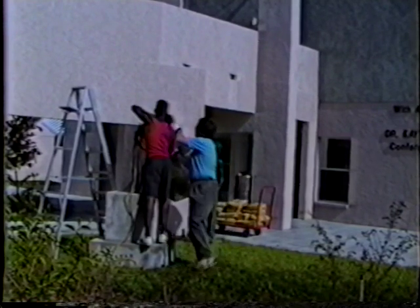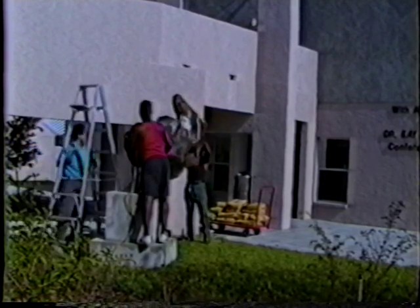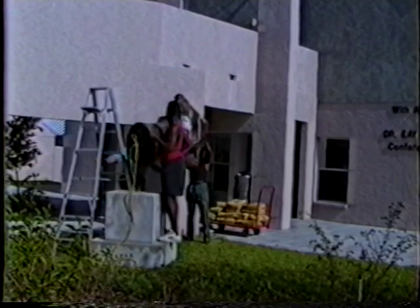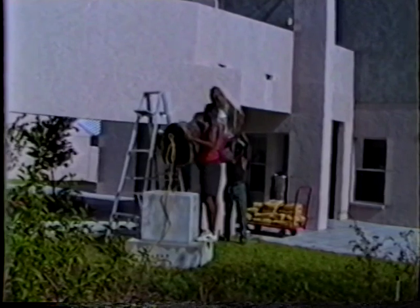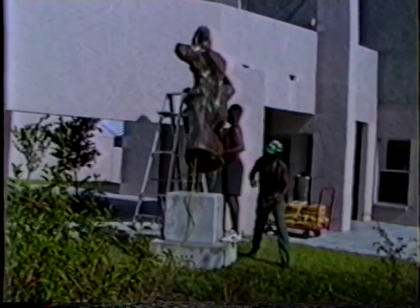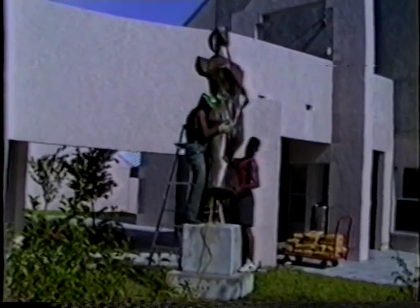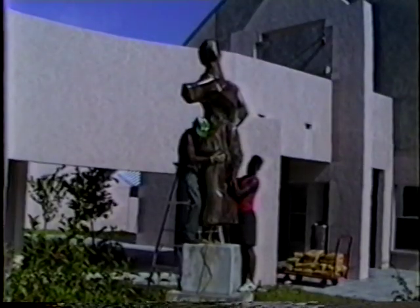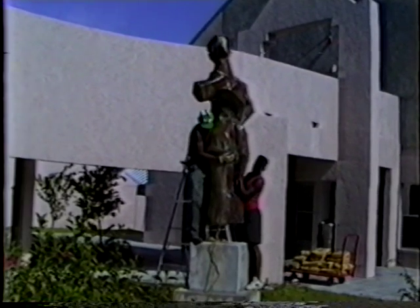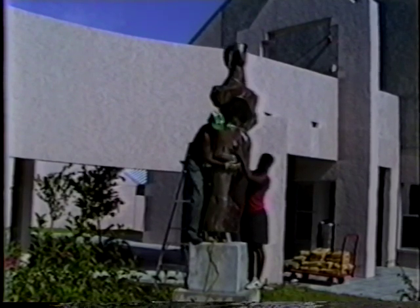So we've tried many things, many techniques of filling this. We've tried filling them with foam and with ready mix concrete. And the ready mix is dangerous because it creates a tremendous hydrostatic pressure at the bottom. If you have any concavities, they tend to balloon outward. So we finally hit upon the possibility of using, as you can see on the dolly there, bags of dry ready mix gravel and concrete from hardware supply. And that works. We put a bag or two in and then give it a spritz with a garden hose.